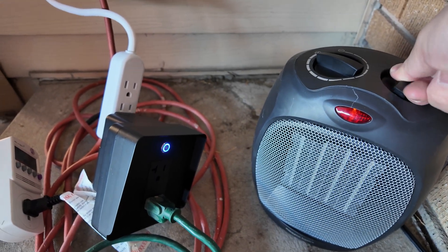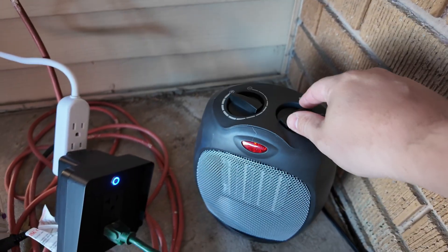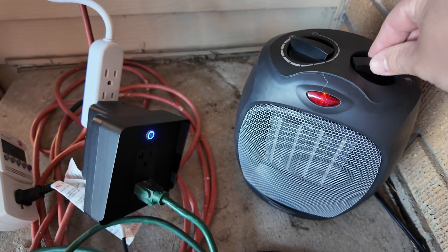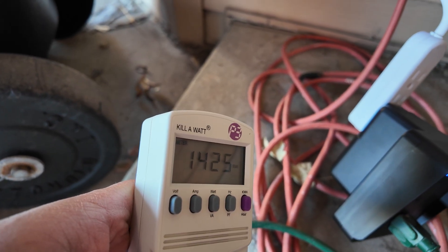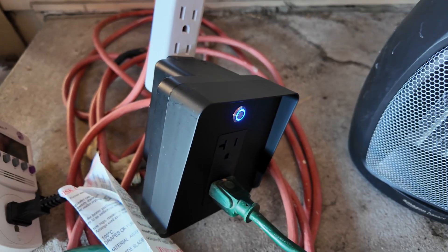Testing mode 16: I turned the fan on, then switched to heat — nothing happened. Still on while pulling around 1,400 watts. So mode 16 is the least sensitive mode and isn't suitable. I then slid all the dip switches up to mode 1, and it already tripped on its own. Mode 1 appears to be the most sensitive. I need to find something between mode 1 and mode 16, so let's try mode 8.